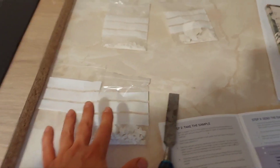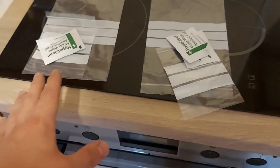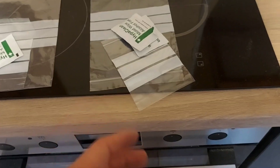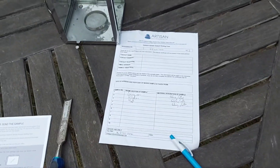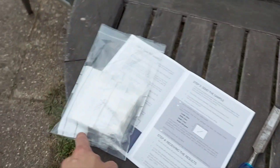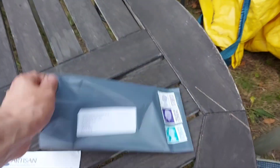Simply take your samples and label each of them up by room — so this one is from my first room, this from the kitchen, and this from the hall to the bathroom. Label them item one, two, three so we know where they've come from. Then each of them needs to be double bagged — put a second bag over each one. Any equipment you've used or touched, just make sure you've wiped it all down with the alcohol wipes, and those will need to be bagged up and sent away afterwards. I've written down where I got each sample from and what type of material it was, just to match up with the template. It's all now bagged up and ready to go straight in the post — it was all prepaid, so it was ready to go straight away.